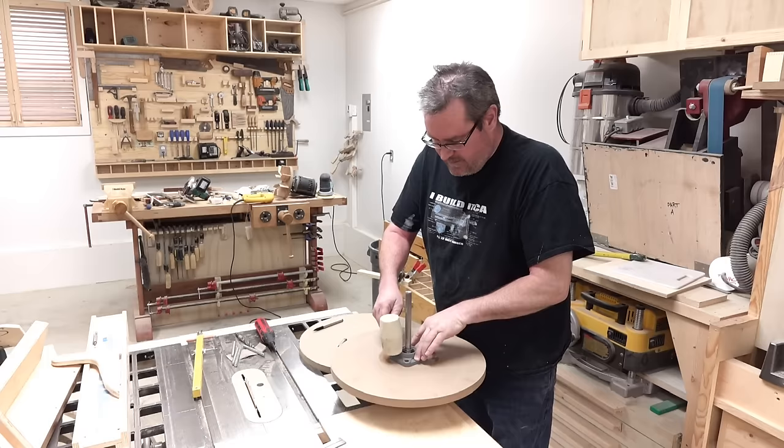I did find the blade starting to drift downwards again, so I stopped. I'm not sure if that's because of the water or if I increased my feed rate, because the water is dripping and you want to hurry up before the water runs out, type thing. Another thing is it makes a damn mess. Everything's covered with water. And as we all know, water and MDF don't mix. Okay, another thing about water, it's more likely that the blade will come off the wheel.